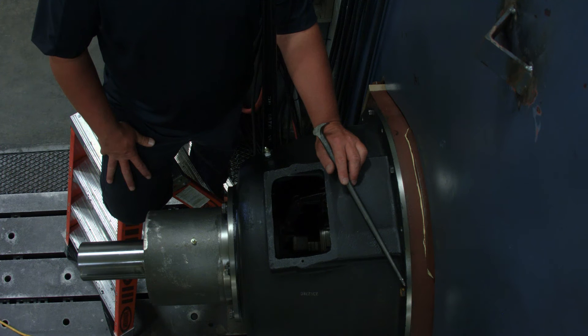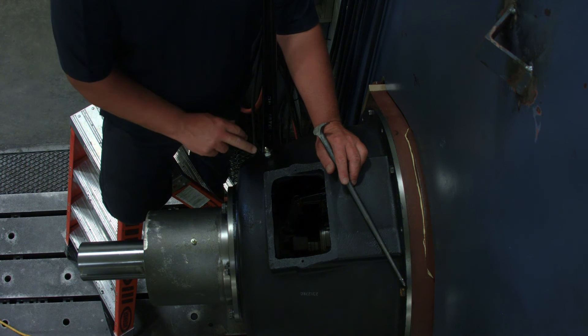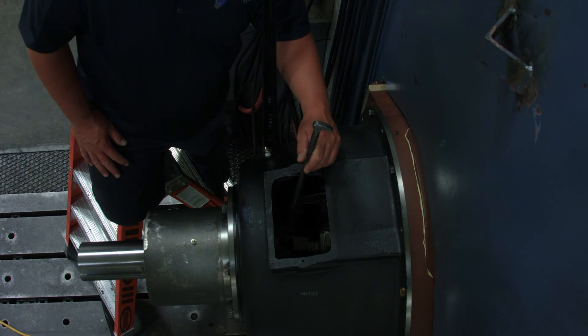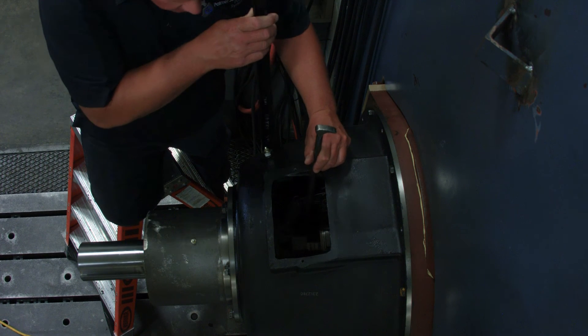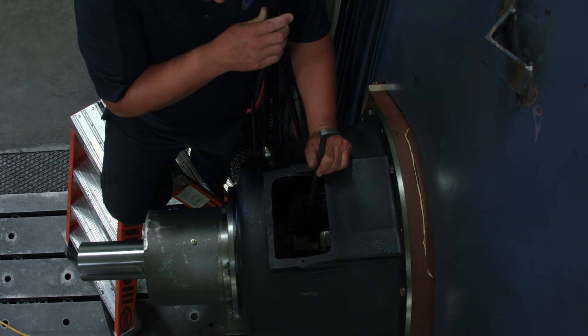Now I'd like to touch on proper lubrication of the throw-out and main bearings. Proper lubrication is three to four shots of grease every ten hours of operation, but once a month it is a good idea to remove the hand hole cover and apply a few extra shots of grease to the throw-out bearing to ensure grease is coming out between the release bearing and the sliding sleeve, and that we are getting a little bit of grease coming out between the sliding sleeve and the main shaft. This helps keep the inside bore of the sliding sleeve lubricated so it slides nicely on the shaft.